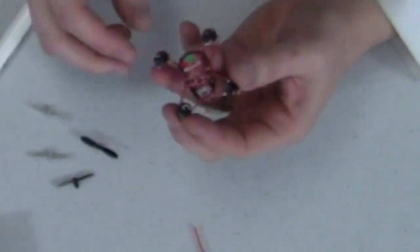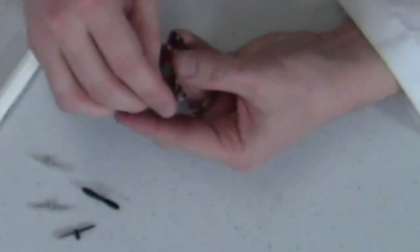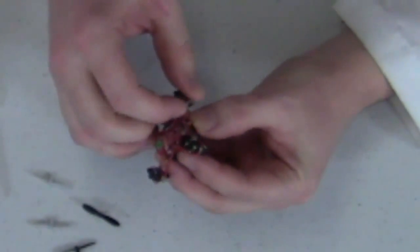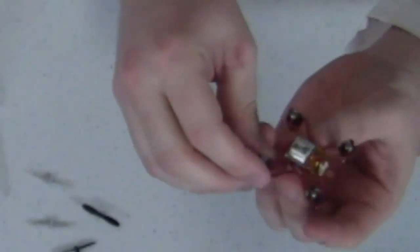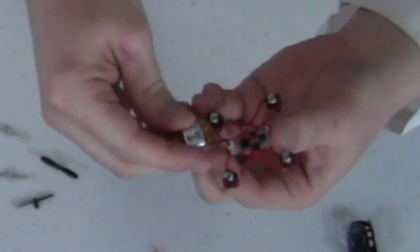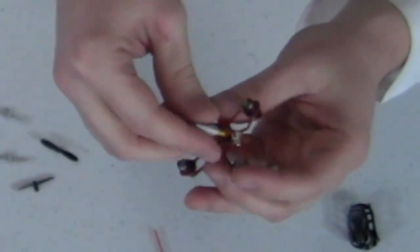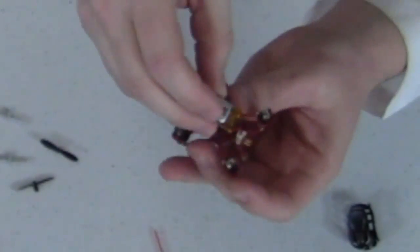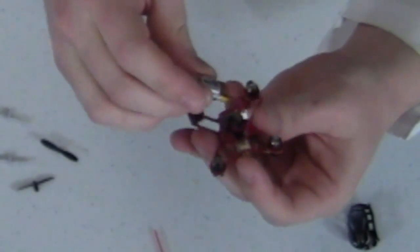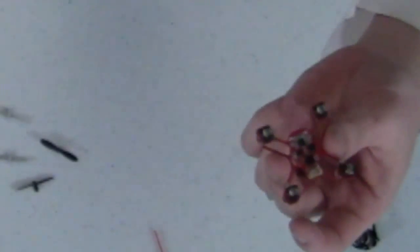The shroud is maintained onboard by a couple of little clips that are very easy to remove. All you need to do is slip a fingernail or a screwdriver under these clips and carefully remove them so as not to break them. Under the shroud you'll find a lithium polymer battery very similar to ours with the foil packs and the yellow tops. This is a standard 3.7 volt LiPo battery which has its own onboard circuit protection inside the Kapton tape. It's good practice when taking apart any electronic or mechatronic device to remove the power source completely before continuing.